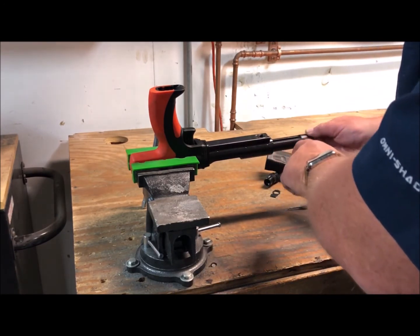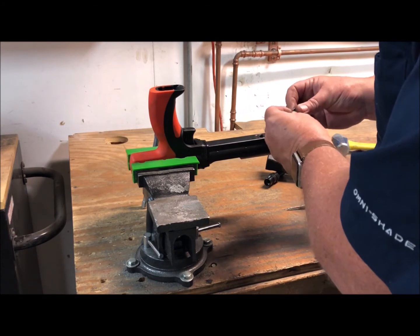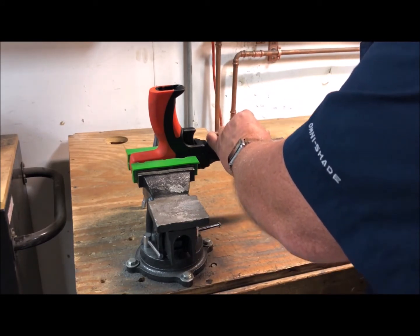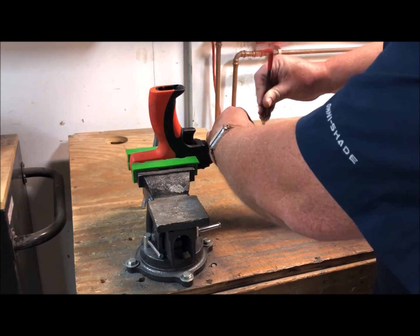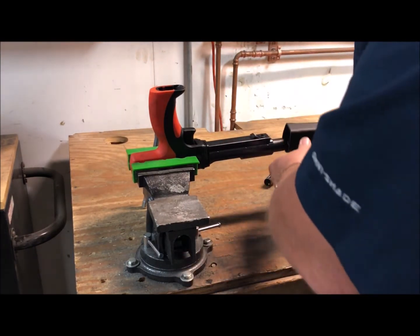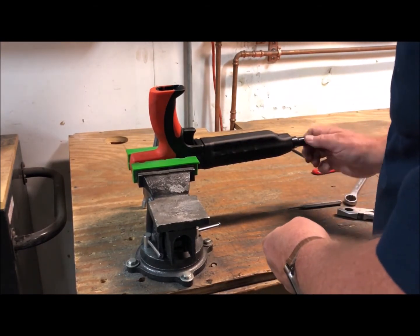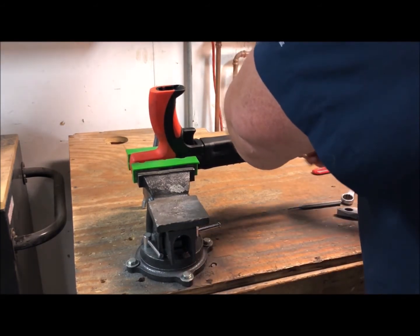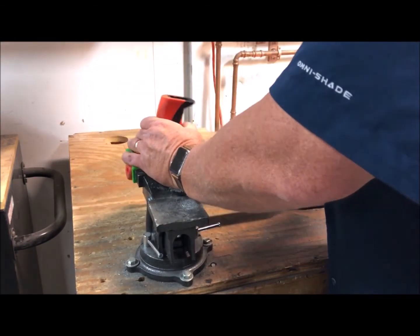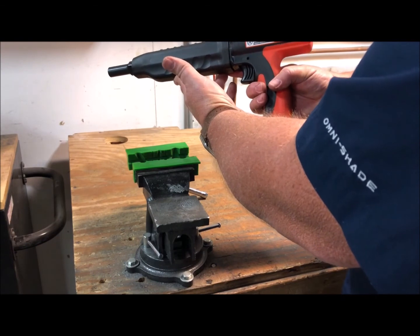Slide the barrel assembly back in, keeping that channel up. Now take the return dog with the spring still on it. You'll notice there's a notch on the clip that corresponds with the front end of the gun — drop that in. It's got a little bit of spring so it takes a little compression to push in, but it's not bad. Snug that back up, then slide the shroud back on. This last piece is the muzzle bushing — spin that on and snug it up. There you have it — that's how you replace the piston in a Ramset master shot single shot tool.